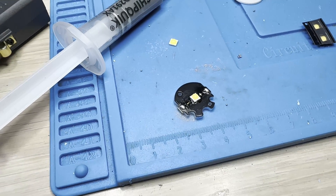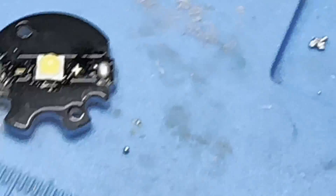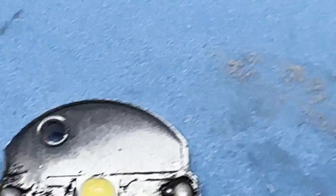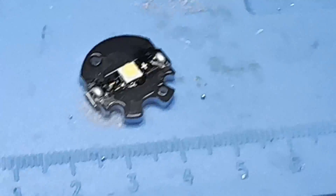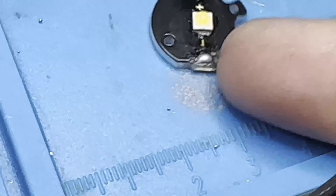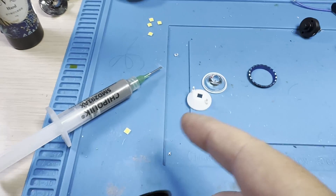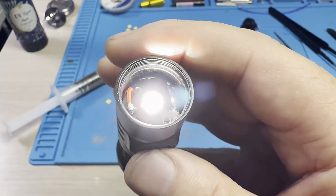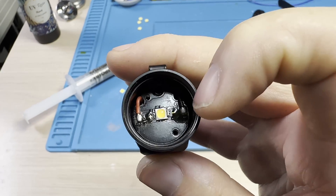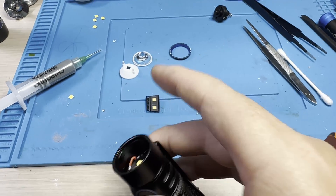I decided to take another run at it — added a little more solder paste. It sits a little higher now; it's showing a little bit on the left but not at all on the right, so it's a little more lined up. You're never going to get it perfect with these, but the closest you can get, the better for the beam, because it wants to be centered in that optic. I got it reassembled without the optic — it's good to test it that way first — and you can see it definitely lights up and turbo seems to activate. Before I test the lumens, I have to throw the optic back in, because it changes the beam, the color, and the lumens more than you'd think.